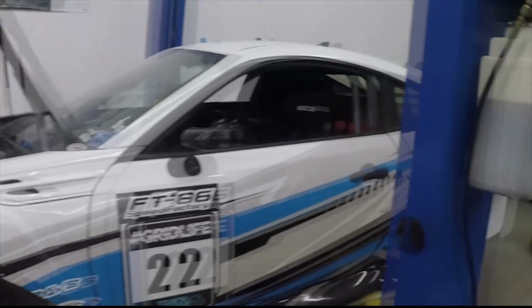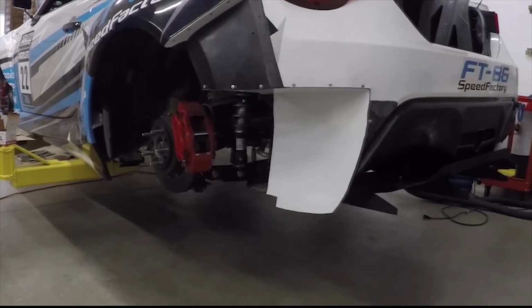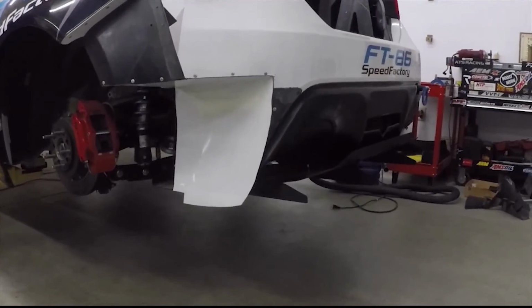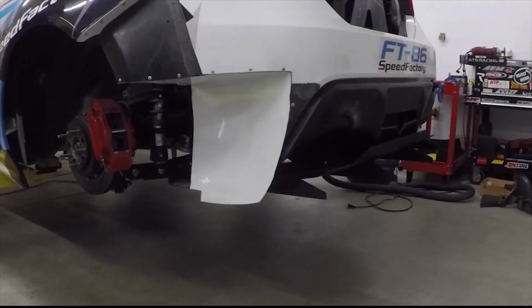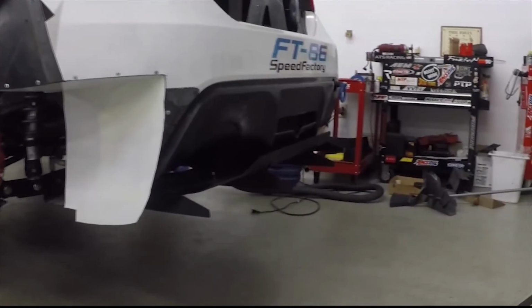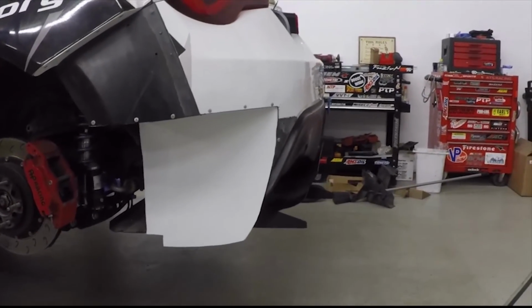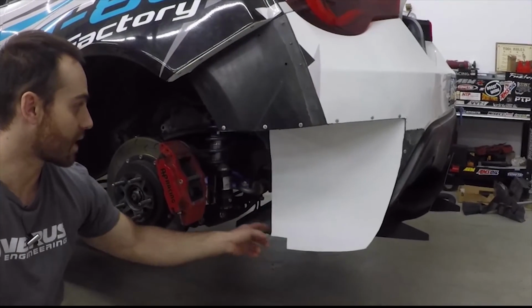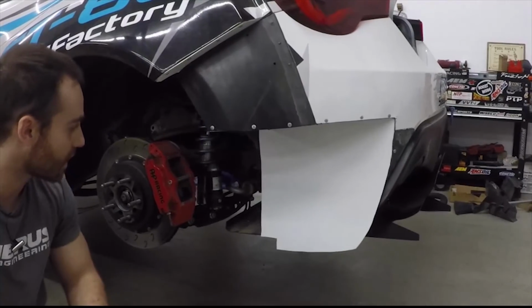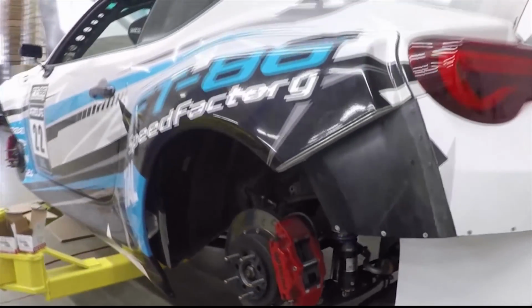All right, my other question is, I'm very curious, what are we gonna have to do differently to mount the off-the-shelf unit diffuser? I know you said we're gonna mount it to the new aluminum fender liner right here, but is there anything else that we're gonna have to do differently? No, it uses the front mounting point and it uses the rear mounting points the same as the off-the-shelf. It did lose the outer one, which basically kind of went right here, but otherwise it retains the 2 main ones. We're gonna basically bolt the off-the-shelf unit to this fender right here, and that will give it a little bit more strength vertically, and we should be good there. If we need more strength, it shouldn't be too hard to use some like splitter ties or something to increase the strength. And if you guys didn't notice, they are running our lower control arms. They have for a while, and our toe links.